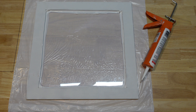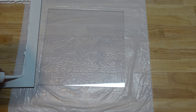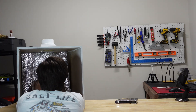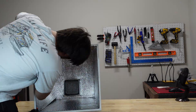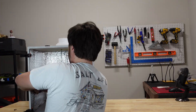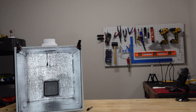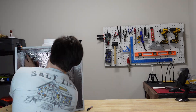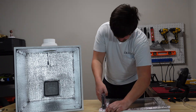For the air-gapped window, I caulked one side, let it dry, flipped it over, caulked the other side of the door, then pressed it over the window to get my quarter-inch air gap. I then added insulation to each side of the box using a staple gun to attach it to the MDF boards. When cutting the insulation, I made sure to size it slightly larger than necessary so there would be some overlap between sheets. I cut a gap for the exhaust fan and power supply, and fit it over. I made a cut-out in one of the squares and attached insulation to the door in the same way.